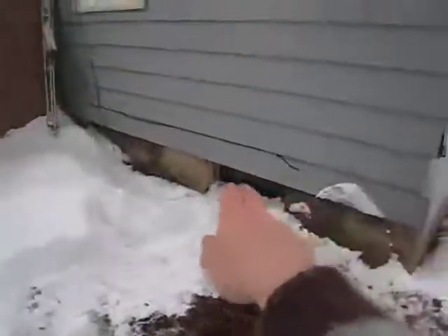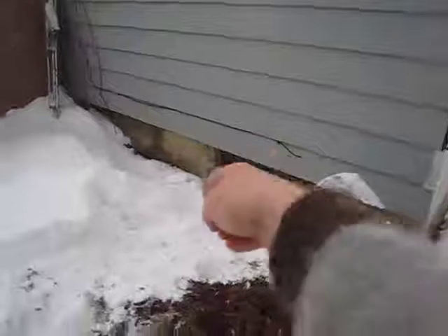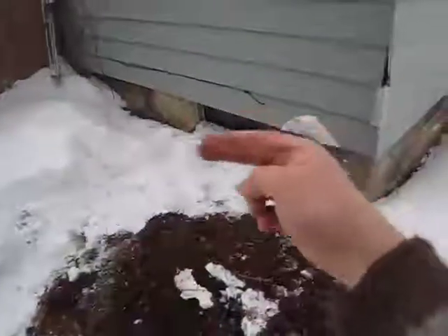That was a glass window that broke, so I replaced it with polycarbonate greenhouse plastic for now. It's chinked with wool to keep the air gaps closed. I'm going to sneak the PEX down into the basement, where it will enter a bank of 55-gallon plastic drums. I can assemble those on site in the basement, connect them with standard garden hose, and then have a basic circulator pump — ideally something cheap and replicable — that will take the water from that bank of barrels, push it up into the bottom, up through the heat stack, and then dump it back down.